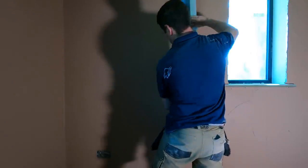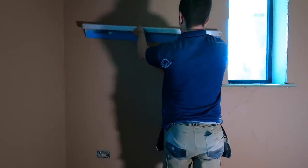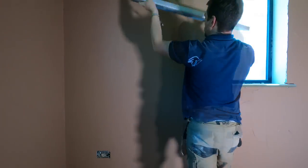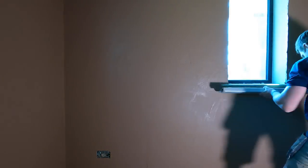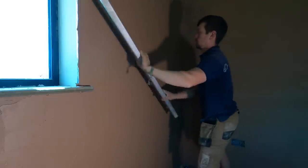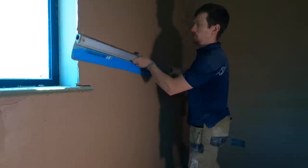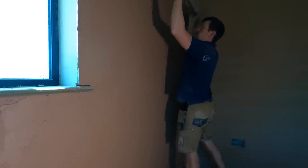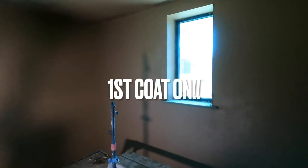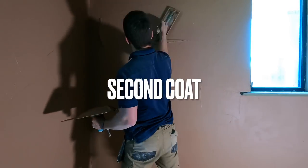Flattening in with a speed skim wasn't actually a problem for the first coat. My biggest concern was that suction was going to go really harsh with the blue grit — I thought it was going to dry out fast. We've got areas with bonding, existing paint, and thicker sections — it's not a perfectly flat wall, it was quite uneven. So it's actually a tough background to be plastering onto, which makes it a perfect real-world test for blue grit. I've got the rest of the room on — three walls — and it does hang well, it stayed quite tacky and was still quite wet.